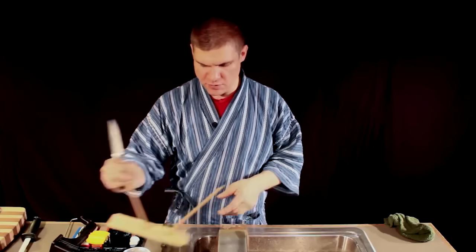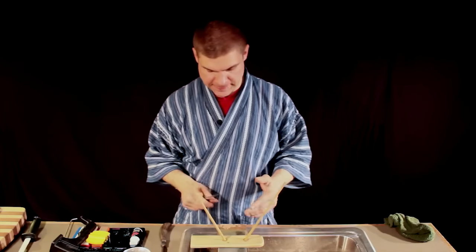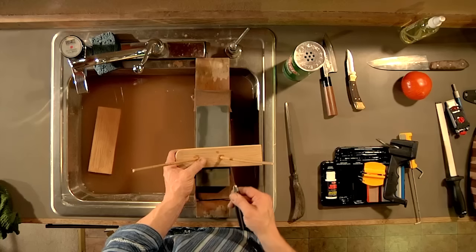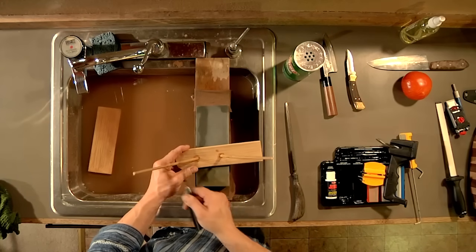Okay, well, how about with one of these sharpening devices with the base and the ceramic sticks? Same thing. If you're going to use this system, if it's all you had, rather than cutting into your sharpening medium, the better technique would be to stroke backwards like this on both sides.